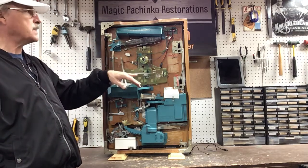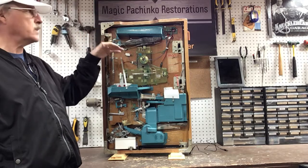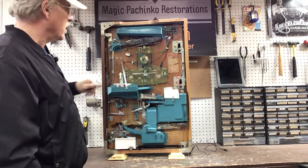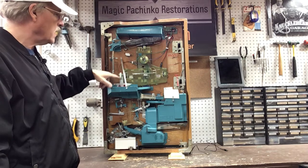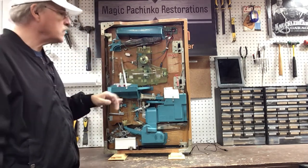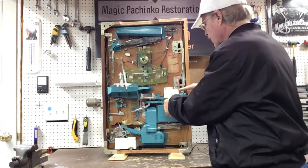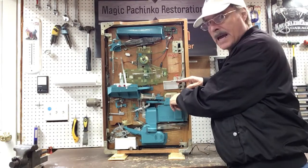Rewired the entire machine. A lot of times the original wiring gets taken off. There were some micro switches and whatever. I redid it all. That's a new micro switch there. New leaf switch here for the jackpot. Both lights work. This one had a big challenge for me. I almost thought I couldn't fix it, but on a Model A, this is your jackpot here.